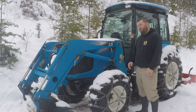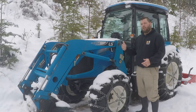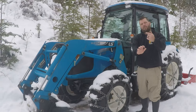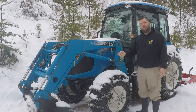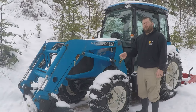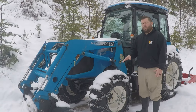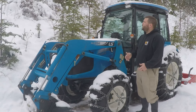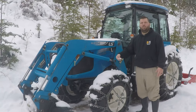I'm going to check the oil really quick. How I normally do this is I put the key in the ignition — I don't even get in the cab. Everything's set from when I park it, the HVAC system, everything. Turn the key, push in the clutch with my hand. There's a little locking thing up there that can hold the clutch down, and I just look and see when that glow plug light turns off. I turn the key on, it starts up. I let it idle all the way down at idle for about 10-15 seconds, then I bump it up to about 1500 RPM and let it sit for about a half an hour. It's warm out here today, but it's still cold enough that that oil is pretty thick and we want to get it nice and warmed up.